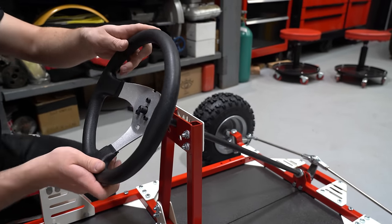These kits will come with a 98cc 3 horsepower engine. These engines do ship dry so you will have to open up the fill plug and fill it up with some 10w30 oil. Your engine comes with a clutch and clutch cover along with the hardware you need. The first thing you'll install are the two bolts that hold on the clutch cover because you won't be able to get them in when the clutch is in place. Next, install the spacer onto the output shaft. Then install your clutch by lining up the keyway, take your clutch bolt, thread that in, and use a 10mm wrench while pulling the pull start cord to keep it in place while you tighten it. With your clutch fully mounted, slide on your clutch guard and tighten down.